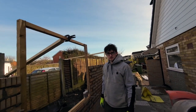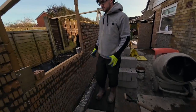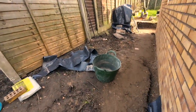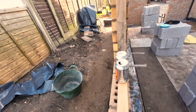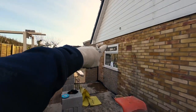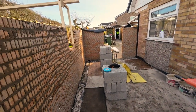And then we're just going to do our normal thing, trestles and planks on the inside. As you can see, we've got a nice level platform to work off, and we haven't there. So what's the point of struggling out there? We can just do 7 courses off the trestles. Like I say, it's only 7 up to lintel height. So yeah, that's the plan.